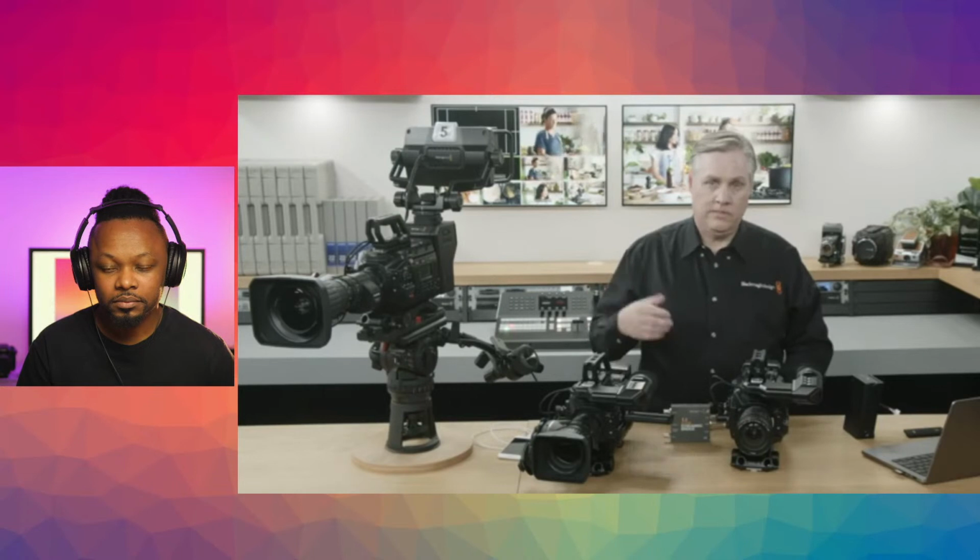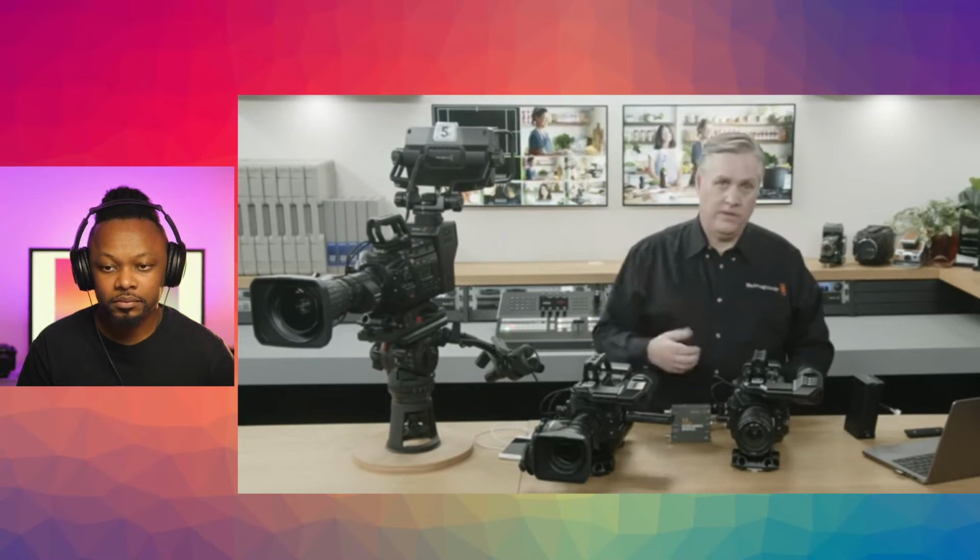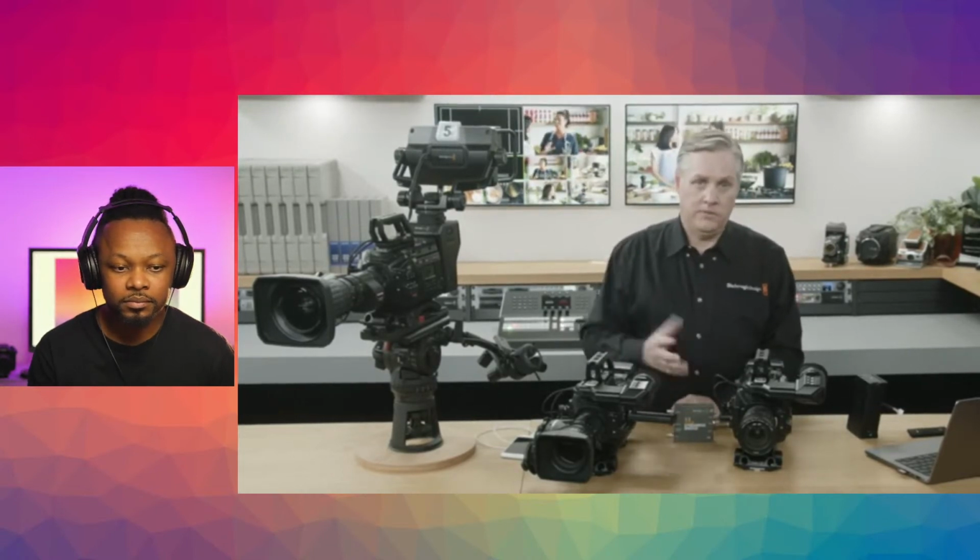So all I need to do is tell the camera where this switcher is. Now that's easy because the ATEM streaming bridge can create a file which can tell the camera where it is. It's the same file that the web presenter uses. The streaming bridge can create the file and give it to the web presenter. The web presenter can load that in, and now it knows where to stream to talk to the streaming bridge. It basically tells you where the streaming bridge is on the internet.